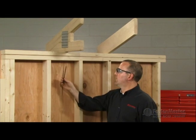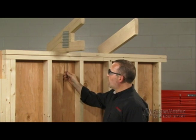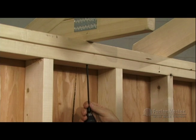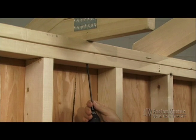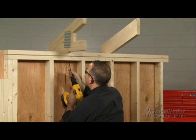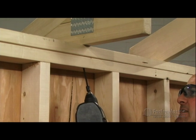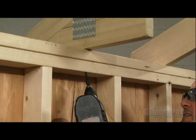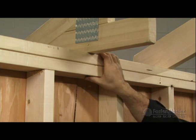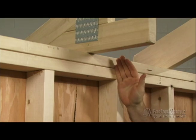Take the six-inch timber lock, locate directly underneath your rafter or truss, start by going directly up and then draw your angle to twenty-two and a half degrees. You can bring it flush or leave it a little proud, but either way you've just made that connection.